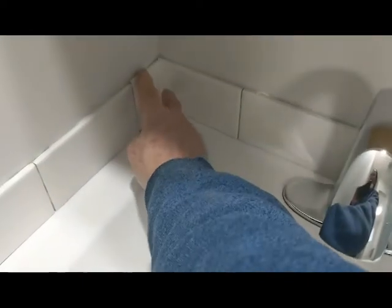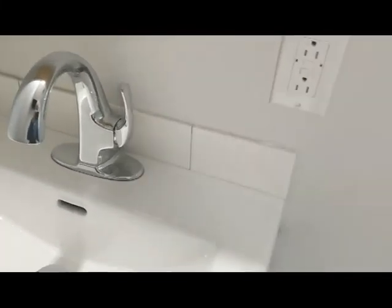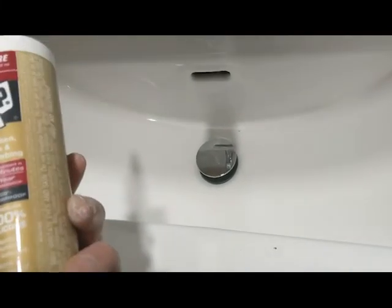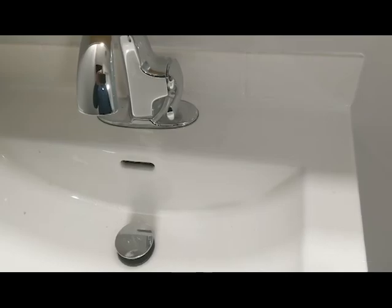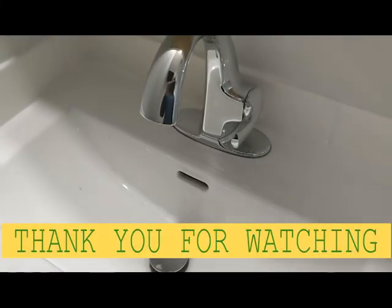I'm gonna do it right away — I'm just gonna silicone it, because the place is just ready to go. I don't have much time to spend on it, so I'm just gonna do all the caulking around, nice and straight, and good to go. I'm using this 100% silicone, just white, putting it around. Yes guys, this is done! I just used the silicone in place of grout because it's just a little bit, and get the job done right away, nice and easy. I love you guys, see you soon!